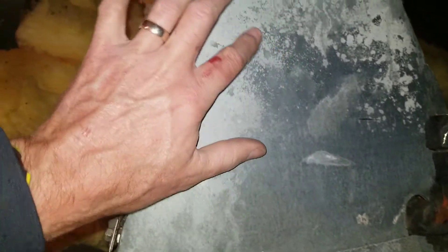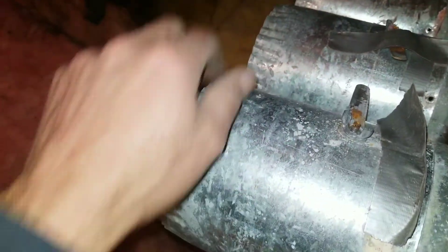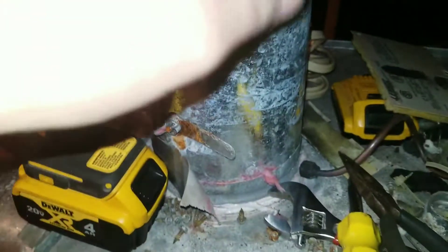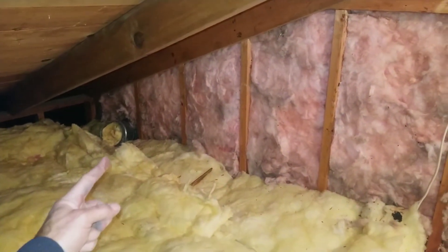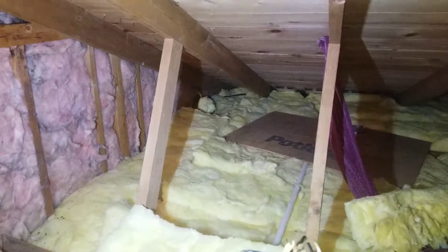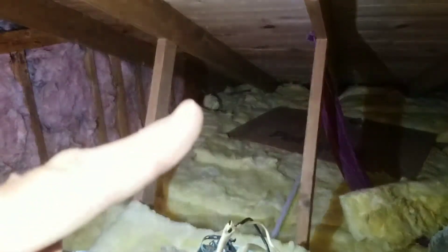The air would come up and out through here. Everything going through this side would go to the master bedroom, bathroom, and girls' bedroom. This side would go up and over to the downstairs. There's another one way back there — you can see that duct — which also goes to the downstairs. So basically you had four coming out one side, and then these all covered the kitchen, living room, et cetera.